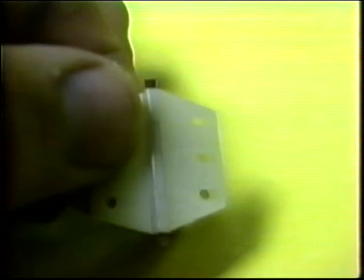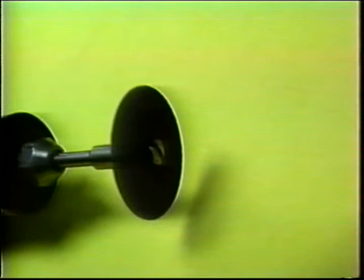But you don't want to run it in so far as to touch the bolt, or else you get a little notch in it. You want to just go in real slow, real steady. Practice on some scrap wood so you can just cut a nice little slot and back it right out. Hold each thing steady on a table, and I'll show you my little technique for doing that. It works well, and you get some really nice hinge pockets.